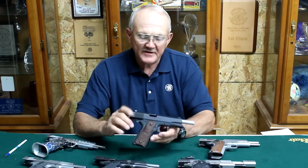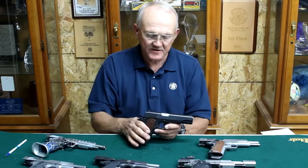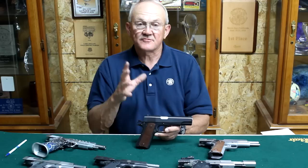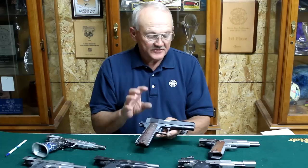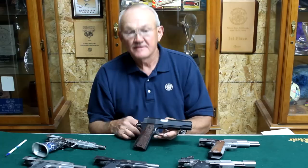The original 1911 was designed so that all the parts were 100% interchangeable. An armorer with 20 1911 pistols on the table could take them all apart, throw every piece in a bucket, wash it, and assemble 20 pistols without any fitting. What that meant for the actual firearm platform was that they were relatively loosely fitted, with harder triggers, so the sears, hammers, and triggers could interchange between one another.